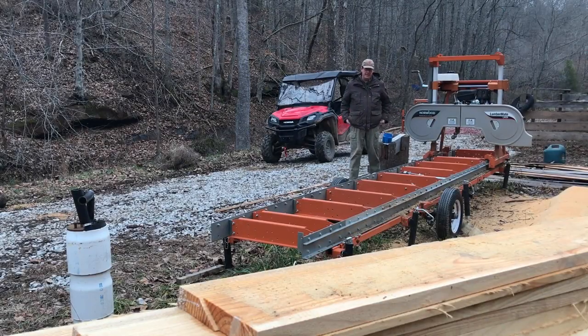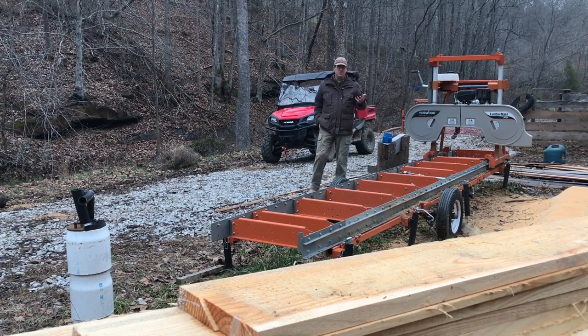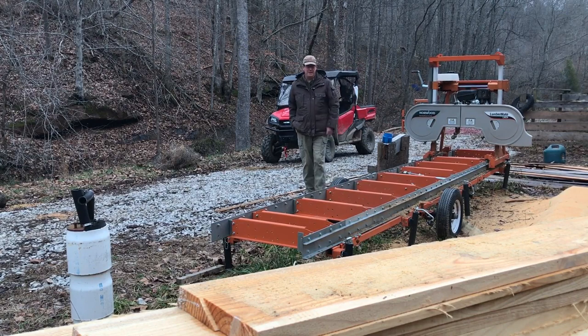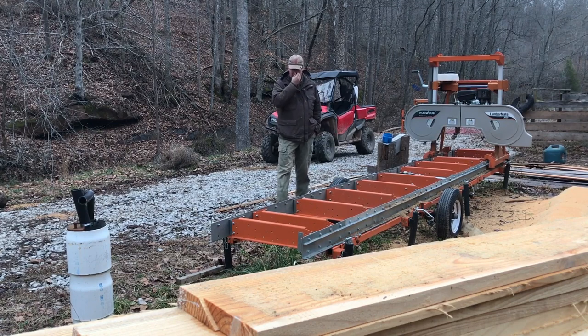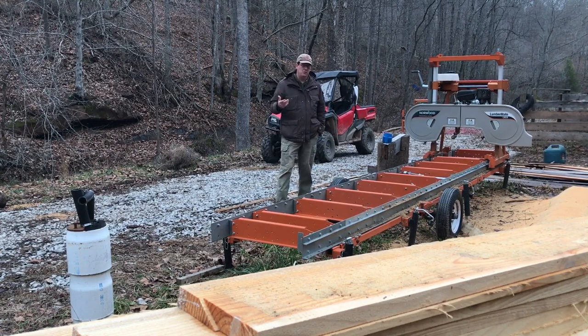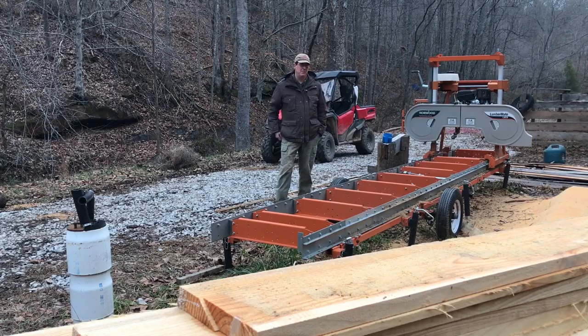So why is this so important in sawing, hardwoods, or rough-cut lumber? When you go to a box store, you say I want X amount of 2x4s so many feet long, and you're not even dealing in board feet. Well, when you go to a box store and buy softwood dimensional lumber, it's already dimensionalized — you know exactly what you're getting. With hardwoods or rough-sawn, there can be a lot of variation. So it's key in calculating cost or total amount of wood that you're going to get. It's usually the starting point, and that's what's used to set pricing.